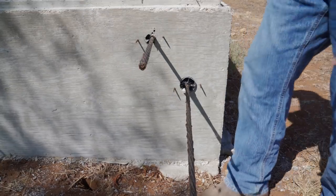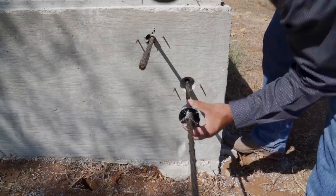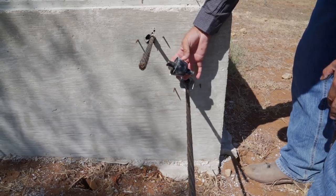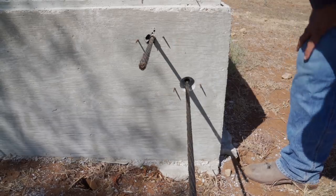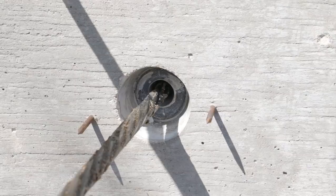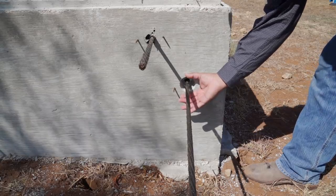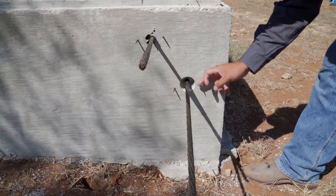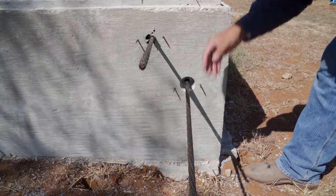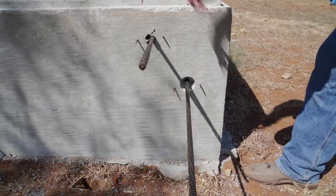There it is — I pulled the plastic cup out. This is what it looks like. Its only purpose is to create a void right here. That's the metal anchor right there. They're going to attach the machine right here, and the purpose for these nails is so we can nail that anchor to the forms before we pour. After we pour, as you can see, this creates a void right there.